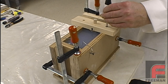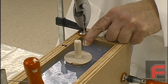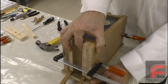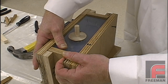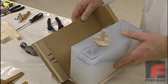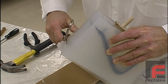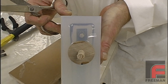The next day, we unscrew and then lift the piece of wood that held our down-sprue. Next, we pull two of our vents out of the mold. Then we remove the first two clamps and remove the mold box from the mold bottom. We remove our last two clamps and pry the two halves apart, revealing our clear mold. As you can see, most of the surface bubbles that appeared at the end of our pour have broken as the mold cured. Here we are removing the flashing around the mold, which was created when the silicone rubber seeped between the plywood sections. Notice how easily we can see the clear tape parting line because we had marked the ends of the tape with a black marker.